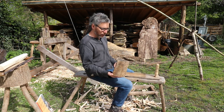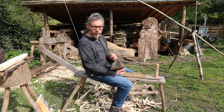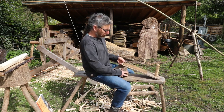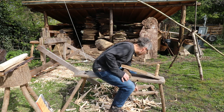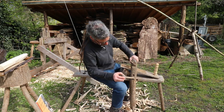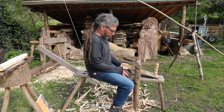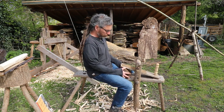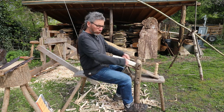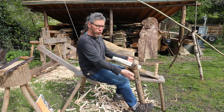We've got this little lump of wood cleft out with different lengths on each side. That means you can adjust it for height — high up, or quickly tip it down and it's lower. That gives you more room or less room depending on where you want to clamp it. If I want to come a little bit lower I flip it down and I can push my foot a little bit more.